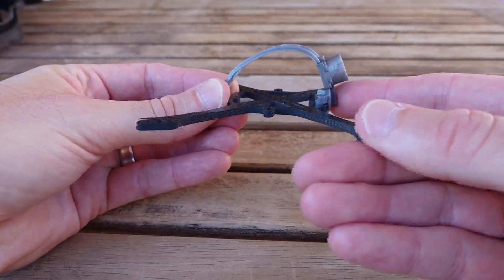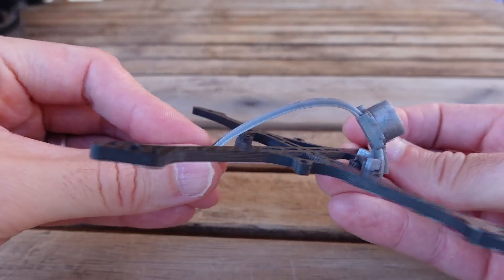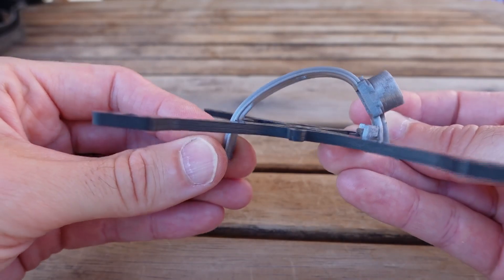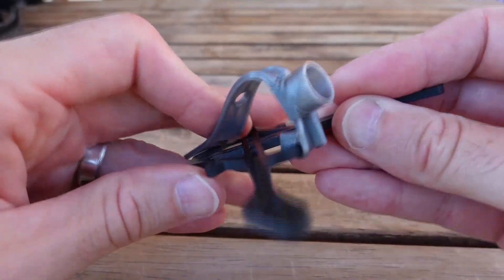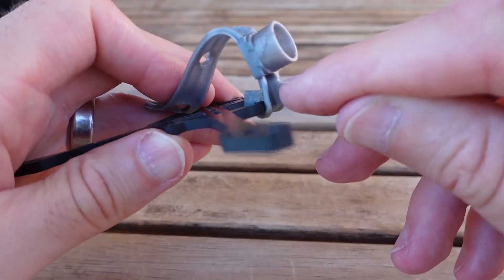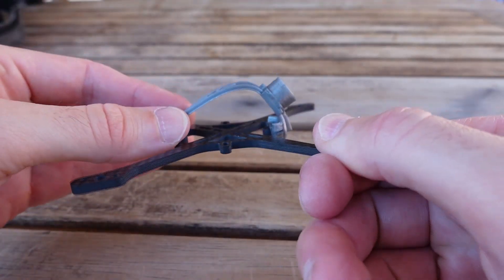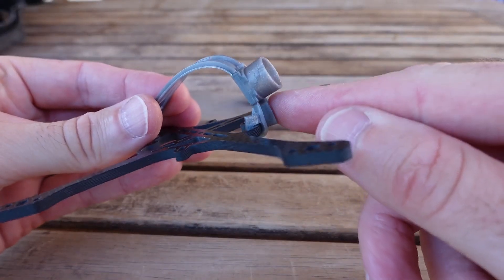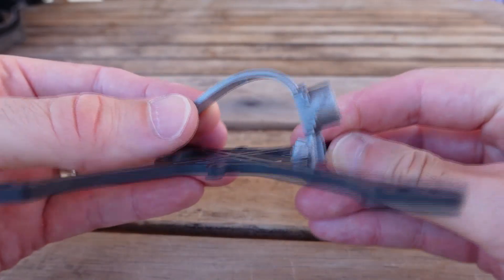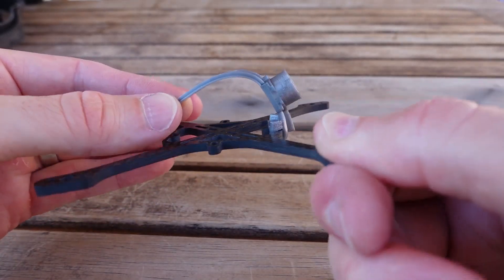If you need to adjust the camera angle, you can either put more tension on the back by using longer screws and building it up underneath, or you can take side snips and make a tiny little cut — there's a notch to tell you where to cut. When you cut it, it's going to let the camera tilt back more and allow more flex. But do that one snip at a time, because once you snip it you can't go backwards, and a tiny snip makes a big difference in how much it flexes.